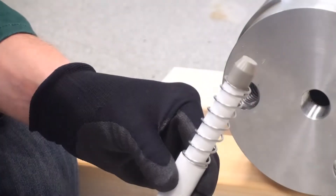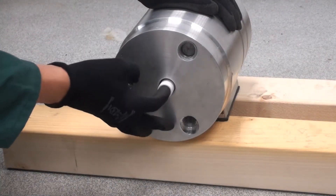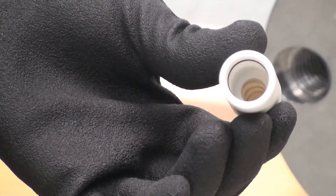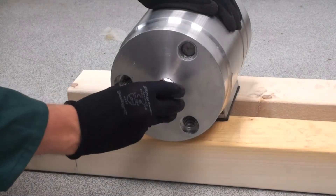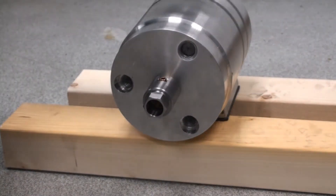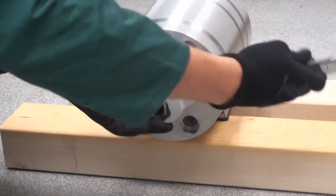Feed the spring over the combined insulator sleeve and feed into each of the hanger bores. This should be pre-assembled with a wiper seal and O-ring. Coat the tapered threads of the lower hanger fitting using a suitable thread sealant and tighten into the hanger bores using the socket and 30mm spanner.